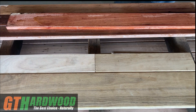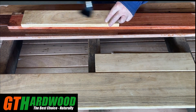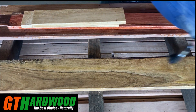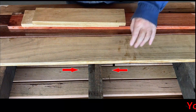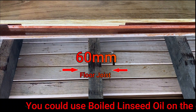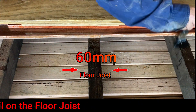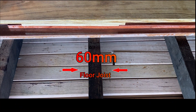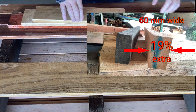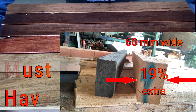Now I'll do the floor joists. It's very important to seal the floor joists — we're doing this to try and keep the weather from entering the holes and cracks in the top of the floor joists. These wider floor joists are sawn at 60 millimetres wide as opposed to the traditional 50 millimetre ones. These wider floor joists are a must-have for outdoor deck construction — being wider they make it easier to join your decking on, and more importantly they are stronger and far more durable.